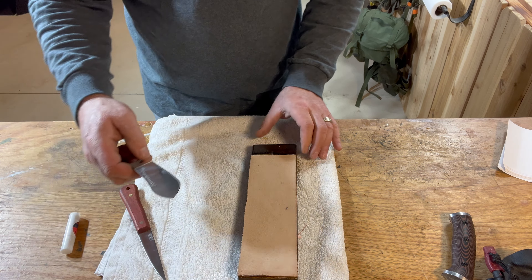I'll explain how that works and why you do this. As you're stropping, what you're actually doing is along this edge — which you can't see because it's very, very small — you're actually rolling the metal away, creating little spurs all along that edge. So when you do it 10 times and work your way down to 9, you're making those burrs smaller and smaller. When you get down to 1, your pressure lightens up and you're making those super, super fine. After you've done that 10 to 1, and 1 ten times on the rough side, you flip the board over.